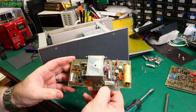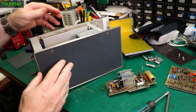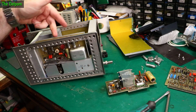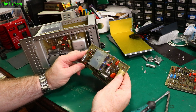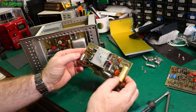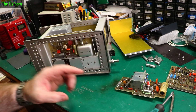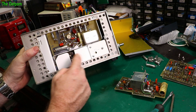I figured I had to get this board out. I had to take the side panel off - there's a screw right there which attaches through the panel. I tested the capacitors on it and I'm getting some bad cap readings on most of them. A couple seem okay but most are testing bad - really high ESRs, 10 to 20 ohms or so. The smaller ones didn't test well. I think I need to recap this board. My normal course of action is to replace every single capacitor on a piece of gear and just have done with it.